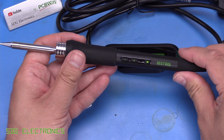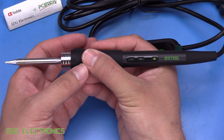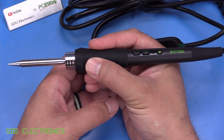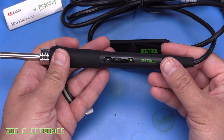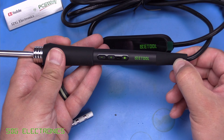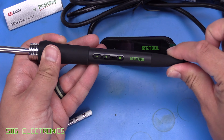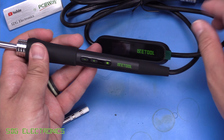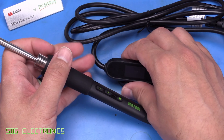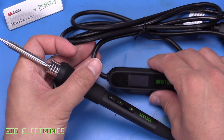The unit is assembled mainly from plastic with silicone sleeves — one where you hold it. It does feel quite old-fashioned because it is actually quite a chunky iron, but it feels pretty comfortable to hold. We've got a very small strain relief, only about 15 millimetres, so I think this is more for aesthetics. We've got silicone wire but that appears to only go up to the control unit, and then we've got PVC — just normal mains cable — up to the mains plug.